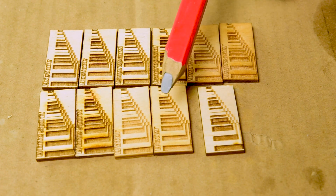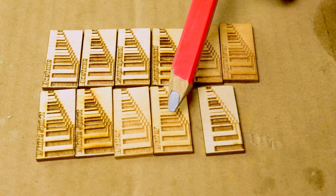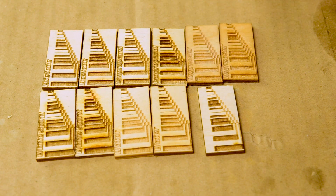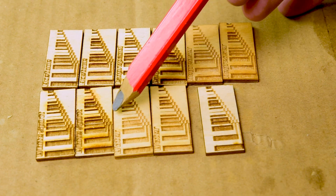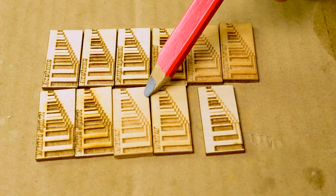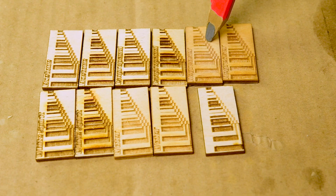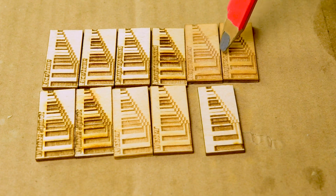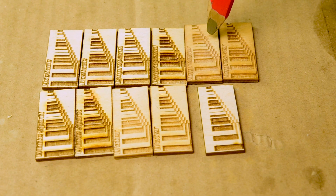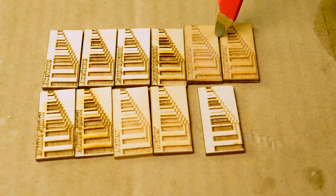Water was very interesting. It did take a lot of the residue, but it also allowed the residue to leach into the wood itself. So it's cleaned away pretty much everything, including the residue in the bottom, but it's also discolored the wood considerably because of it. Not to the point that the degreaser did. The degreaser also removed pretty much everything, but it also made a very dirty slurry of rubbish, and I also don't know how well that would finish because degreaser is quite soapy, so I don't know if you were to put a finish on there, it would work.